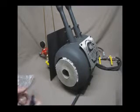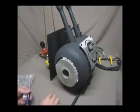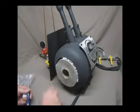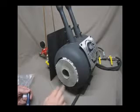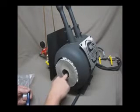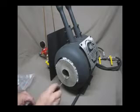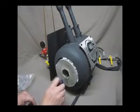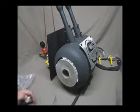Now just a note on alignment here: the actual insert chamber or floor that you've got on the inside of your forge needs to align roughly horizontally with the bottom of this little hole here. So just to recap, the bottom of this hole lines up to the insert floor that you've just added.